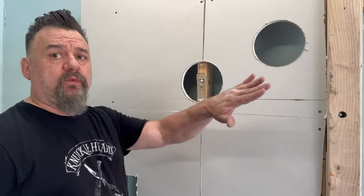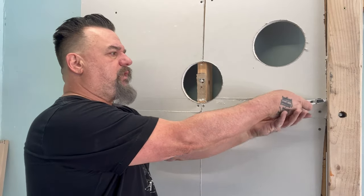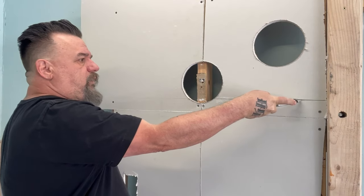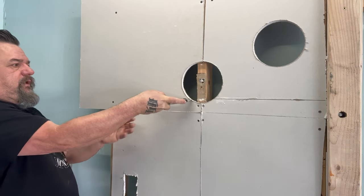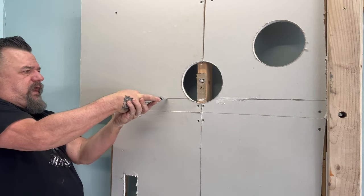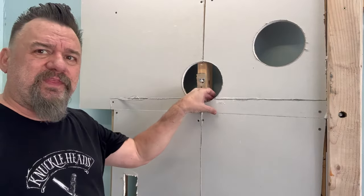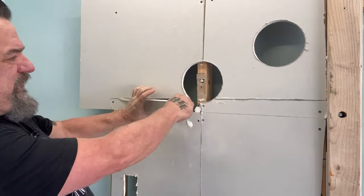All right, let's give it a try. This is painted over, it's years. So you take your razor knife and run it right along the drywall. Let's say you wanted to run six, ten feet. Score that about five or six times. Now that we're done scoring, look at this — that's a straight line. I can take that drywall right back out and put it right back in place.